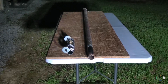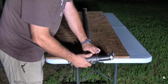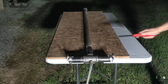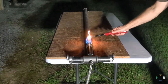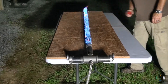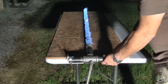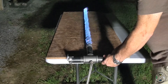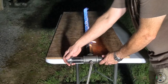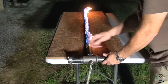We're out here at night — let's try out this homemade Venturi with our homemade pipe burner. It looks like it's working good. I'm going to show you what our air control does here. You're starting to get some yellow tips in there. And that's really restricting the air — so it does make a difference.